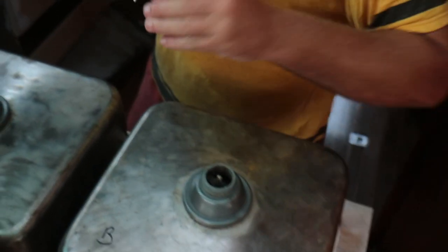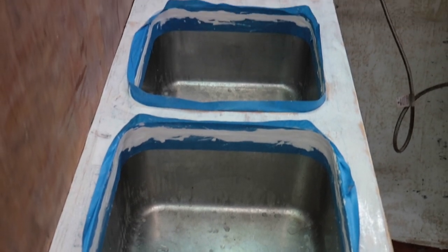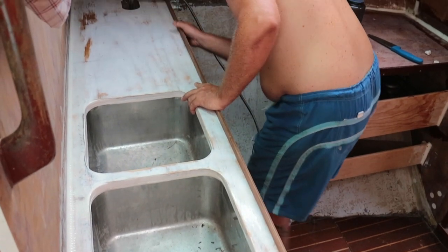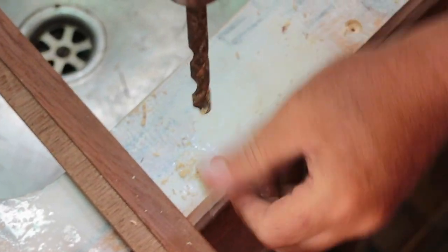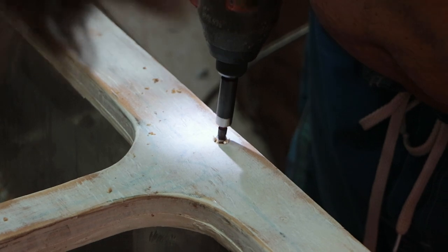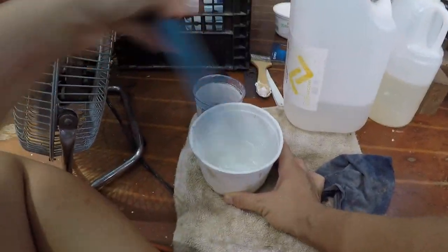There seems to be two schools of thought on the sealant application: peel the tape before it dries or peel the tape after it dries. In this case the room temperature was so hot that the sealant dried before I could peel it, so a knife helped to find the edge of the tape. Squeegeeing the extra Sikaflex away also would have helped to peel the tape nicely. Now all that was left to do was attach everything together, including the countertop and the countertop raised edge.